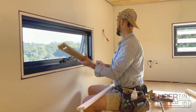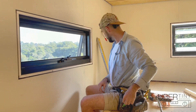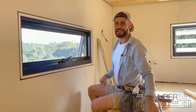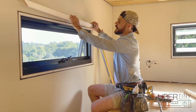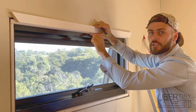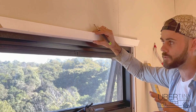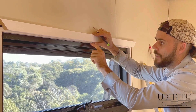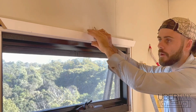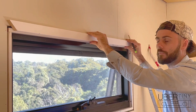Once that's done, it's time to measure. But first, let me talk about the quirk, because it's very important you understand what it is. When we nail the architrave into the reveal and wall, we leave a small gap — a space of the reveal left exposed — and that's what we call the quirk. Go look at your windows at home and you'll see that the architrave leaves a little quirk on the reveal before it starts. You can go with different amounts for that quirk, and we need to understand it before we can measure.